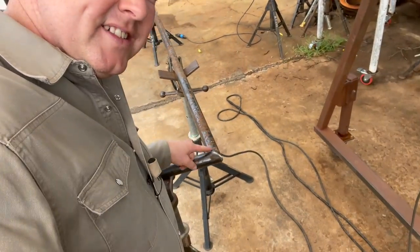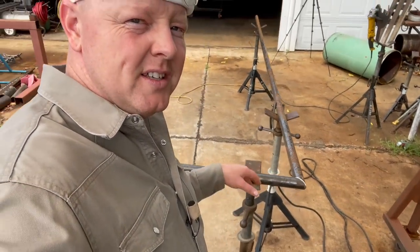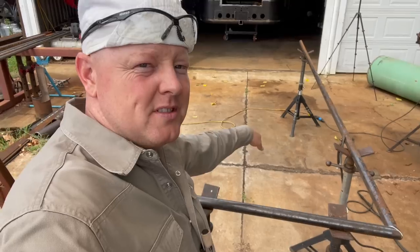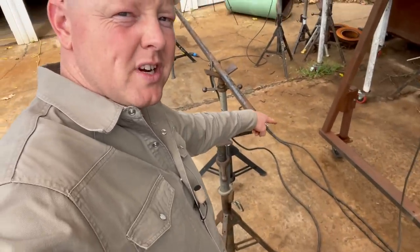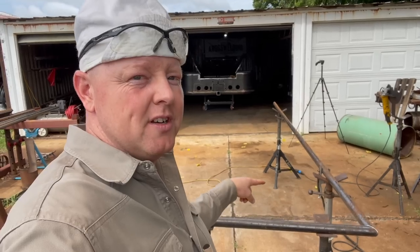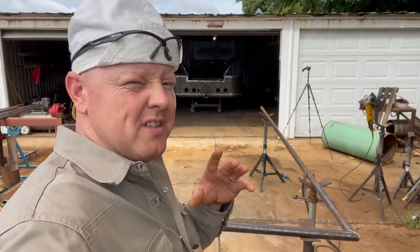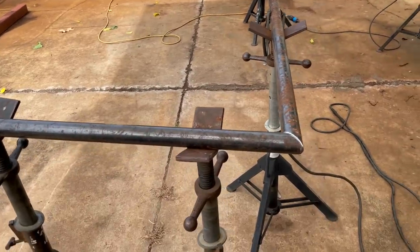As long as what you're welding here is all lined up like it's supposed to be, in theory, this piece could be off and this one could be off, but if this is lined up correctly, it doesn't really matter with just two pieces. Where it's gonna matter is whenever you go to put a third piece on. So I hope that makes sense. And if I'm wrong, somebody comment below and let me know. I'm always trying to continuously learn around here.